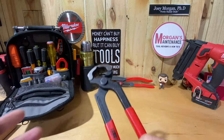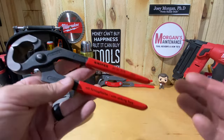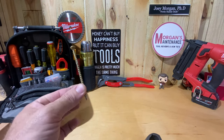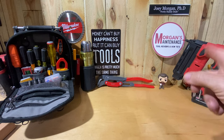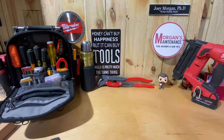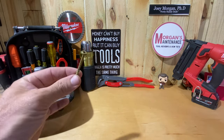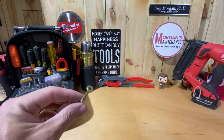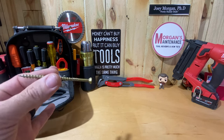I'm not going to demo a house with this as my hammer. I'm not going to go around and frame with this as my hammer. I'm not a nail person — I'm a screw person. I always use screws for everything other than when I'm doing trim, whether it's 18, 16, or 15 gauge trim. Sometimes I even use trim screws on doors instead of nails because it gives me more adjustment and more ability to allow the stuff to move if I need to.